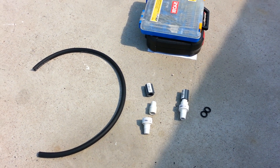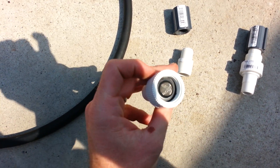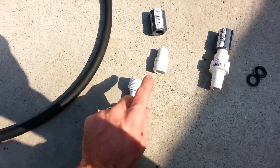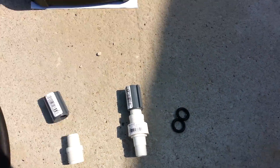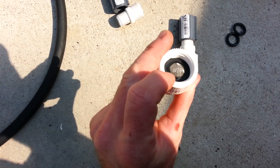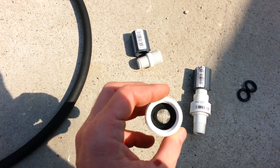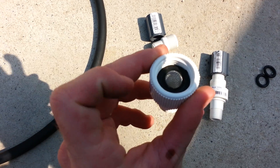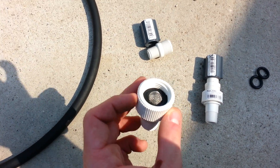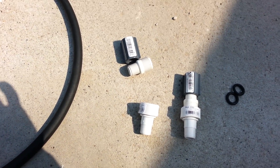So again, to go through it one more time: all you would need is a hose bib fitting — female and male — with the gasket in between, screwed together. It doesn't matter what size it is; use whatever size you choose, three-quarter, half-inch, whatever, plus a coupler. That's how it works — pretty simple. You could always double the screens up, put one facing one direction and one facing the other, for double protection. These are pretty beefy screens; they're really tough. It would take a lot to blow through that on a back flash from gasoline, so it'll last a long time. Alright, hope you enjoy — please rate, comment, and subscribe. Thank you for watching.